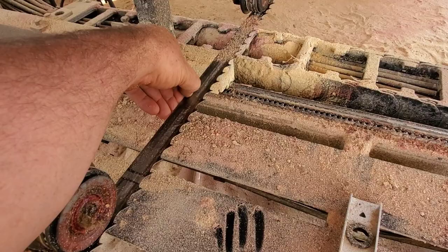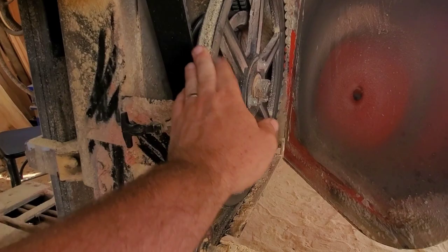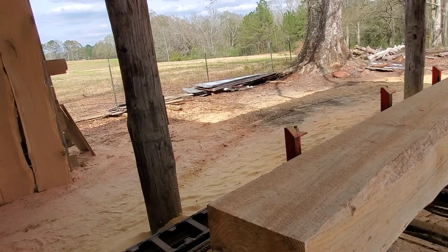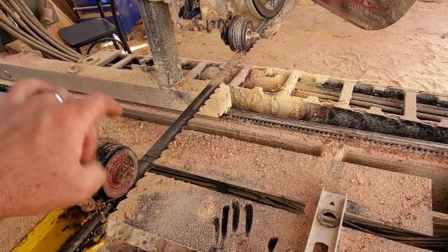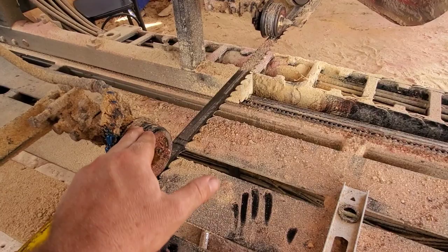You can see there's a lot of pitch on here, and I was only running water — really good practice would be adding a detergent. There's buildup on the bearing and on the wheel as well. When I was initially cutting this log I didn't get much buildup until the very end, where there's a big pine knot area. This is a real-world scenario showing all sorts of crud on here. If you start getting a lot of buildup on your guide rollers, that can cause your blade to push down artificially more than it should — there's supposed to be only a little bit of downward force, not a whole lot.